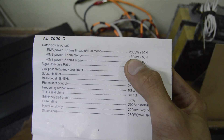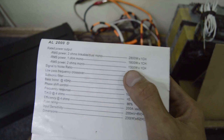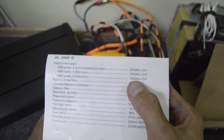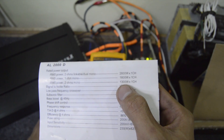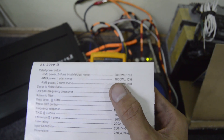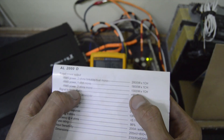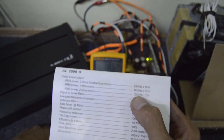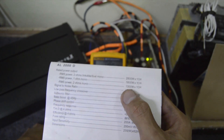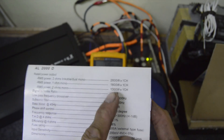The RMS might be about half of that — so around 900 watts. And for two ohms, the RMS... how did they manage to get 1300 watts at two ohms? It's supposed to be half of 1800. If it was 1800 peak at one ohm, it was supposed to be about 900 peak at two ohms. And for four ohms, 450 watts. Just tell me if I'm wrong, or if this is simply lying.